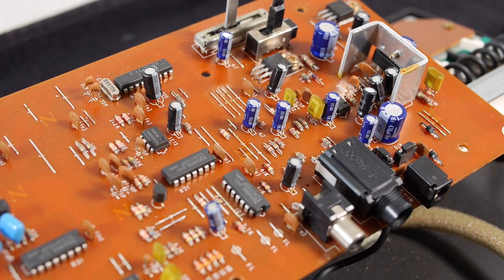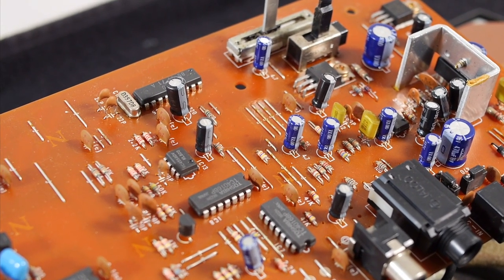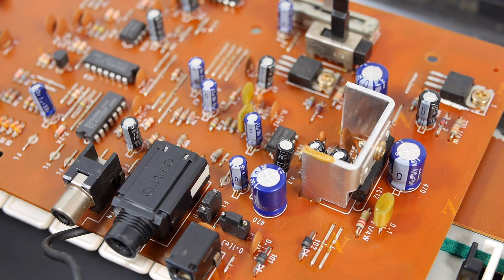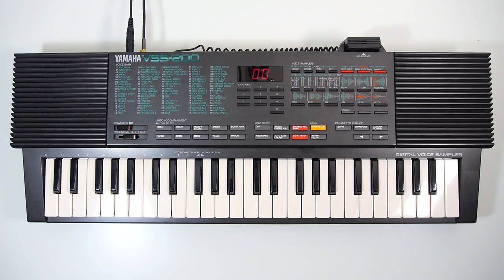As I mentioned earlier, the YM2420 FM chip is a cost-reduced version of the famous YM3812 or OPL2 chip. Compared with its full-fat relative, the YM2420 can only generate 2 types of waveform instead of 4, and the channels are not mixed using an adder. Instead, the chip uses time division multiplexing to play tiny segments of each channel one after another. The result is a very noticeable grittiness to the sounds. Here's an example, with some compression added to bring out the noise.